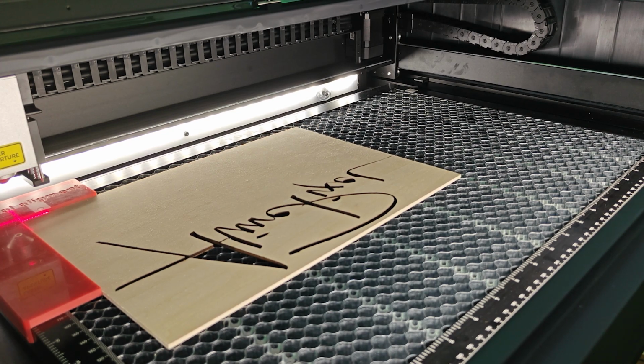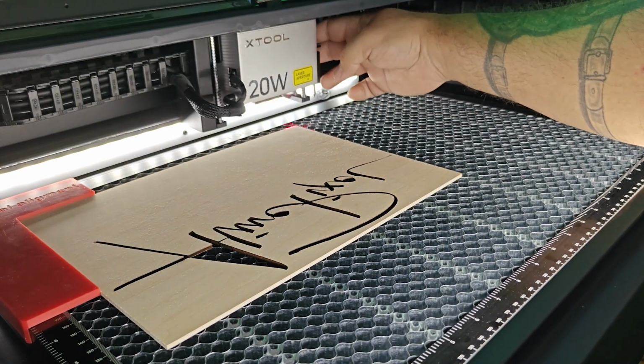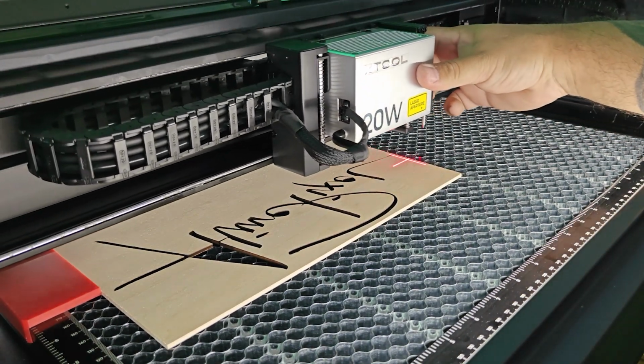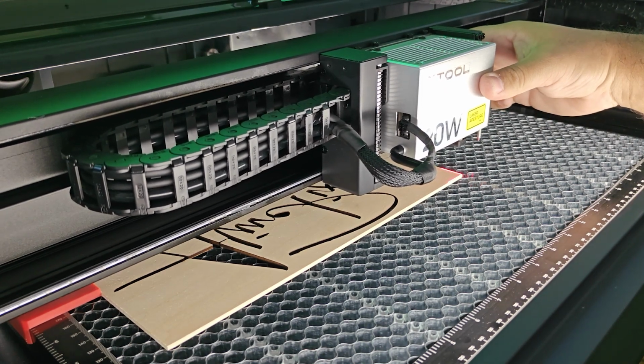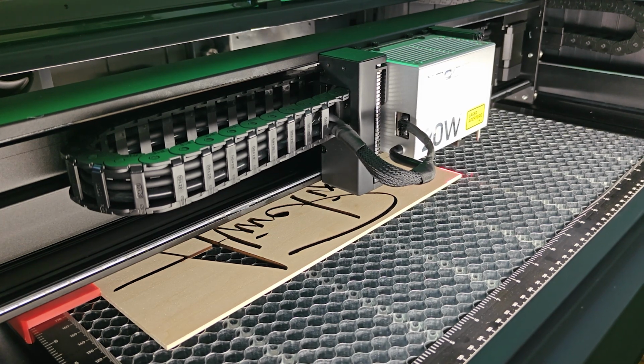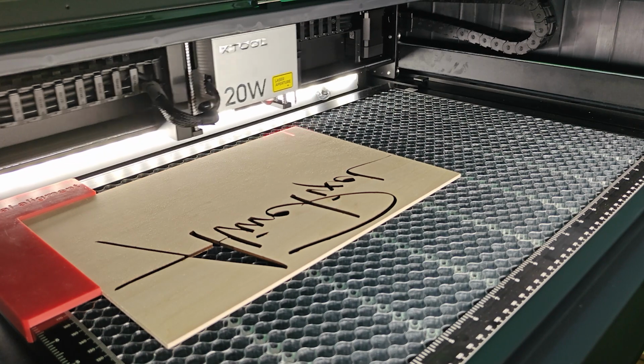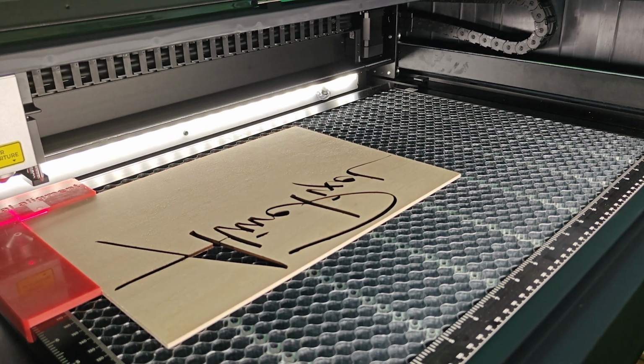So what you do is you press the button once on the front of the machine. After that beep, you're confirming that you have the first corner. So you move your module, and down here on the next corner is my second stop, and I stop. Now I can hit done in the software and I can send my machine back to home. So the machine will go back to home and we're ready to use that size of material.